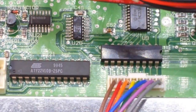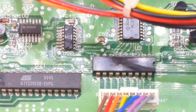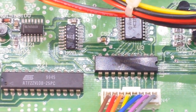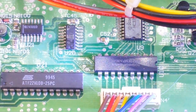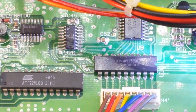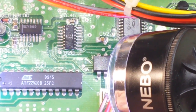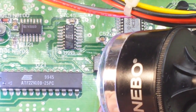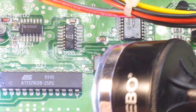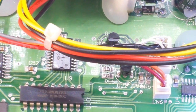There's a Toshiba chip here — shining some light across it — looks like TD6-something, which is a transistor array. There's also an ATMEL ATF22V10B-25PC — not sure exactly what that is. And over here we have HC245s, which are octal bus transceivers.